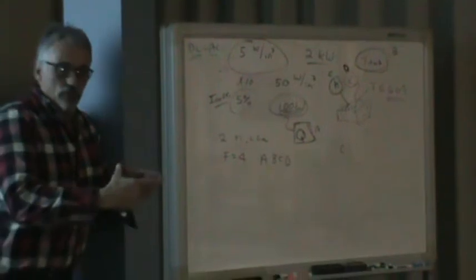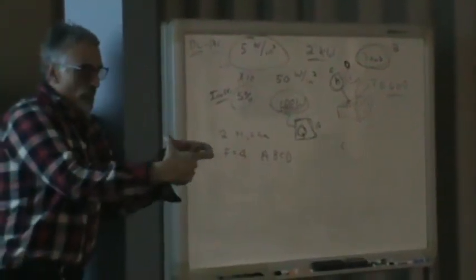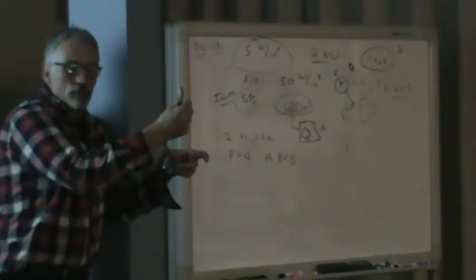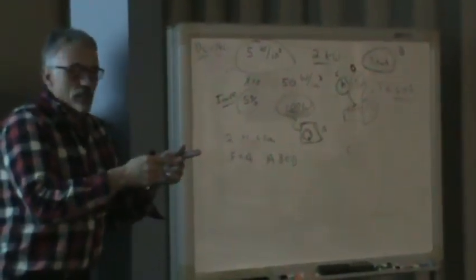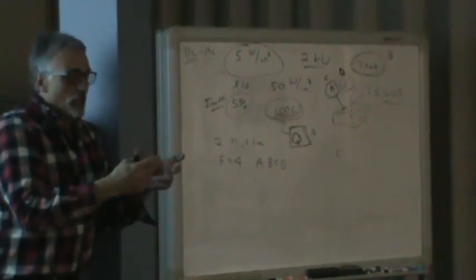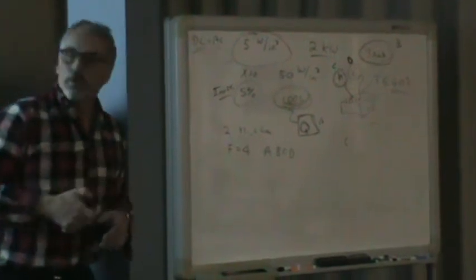I could have looked at the sides and the bottom, but if you looked at the heat transfer, the bulk of it, our box was a form factor like that. The bulk of it was off the top, very little off the bottom because you don't get much flow. And the sides were a similar convective coefficient to the top, slightly less, but they're a lot smaller area. So the bulk of the heat loss is off the top. That was the one that mattered the most.